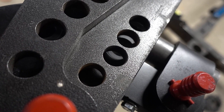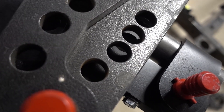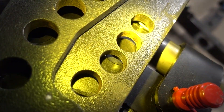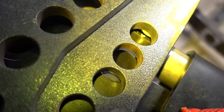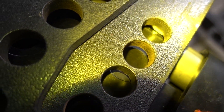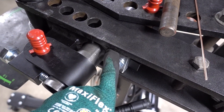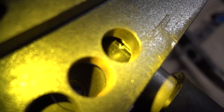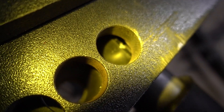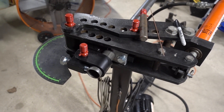The reason I showed you on the other side with the follower taken out was so you could see the mark right there. If you look out here it's kind of hidden — it's under this plate right here. You can see it once you slide your tube in; you can see the black marker mark and a little notch with white paint on it. But I just showed it to you out here because once the thing's together, it's kind of hard to see. Now we'll start bending.